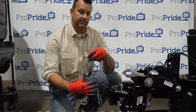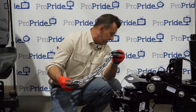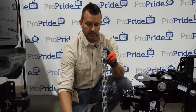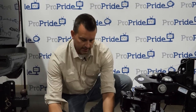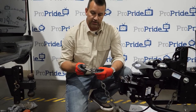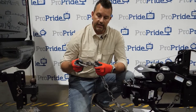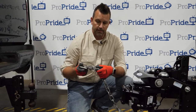The second two pieces are the chains. We extend the chains — these come in 16-inch extensions with clevises. With the clevises we send with it, you get two of those. It'll extend up to 16 inches. You just extend your chains right like that and then put it onto your hook. I actually have a clevis on my hook as well because these hooks didn't have a way of bending them out. If you need extra clevises, give us a holler — we can always help you out with that.